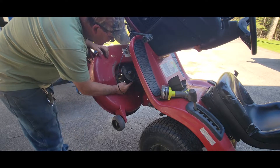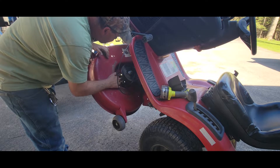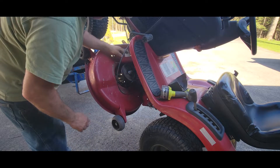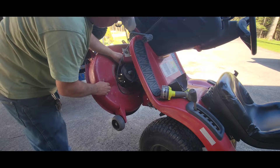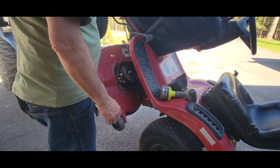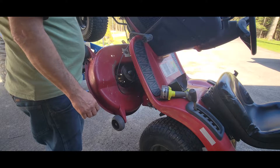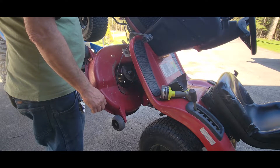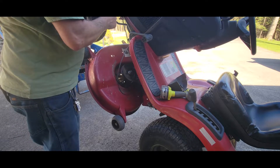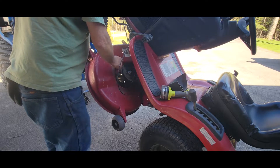As I'm looking at this, the guide comes down, comes across through two spindles, bolts here, and then it's missing right here. See the shiny spots on this side — that's where it goes. I could buy that part, it's probably 20 bucks but with shipping and tax you're talking 30 bucks. I don't know why I can't just grind that a little bit and weld it. It's just a guide that holds a belt on. This belt kept tossing off in the fall.